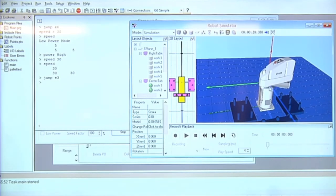But in our case, if you're at your desk and you have SolidWorks, you drop in a robot from SolidWorks inside your coordinate system, figure out my X, Y, Z, and U is for like a tray, and then run a cycle study based on typing those points in my point file. And what's nice is I could pull that G10 out, I could put an RS robot in. Do the exact same thing, as long as my Z's and my U's can reach all those points.